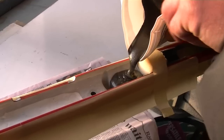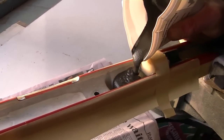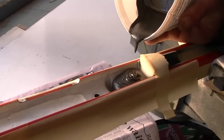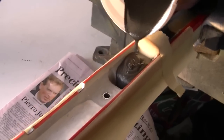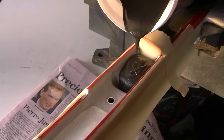I've folded the edge of the container over and I'm pouring the compound in, just letting it gradually migrate to fill voids. I'll just let that compound run and ease into that recoil lug recess. You can collapse the mouth of that container into a point and that'll really let it pour in a drizzle.